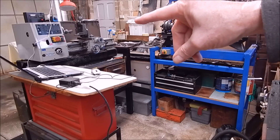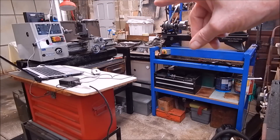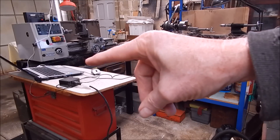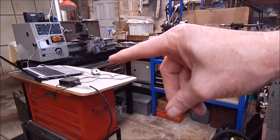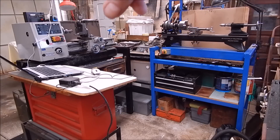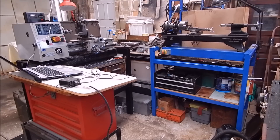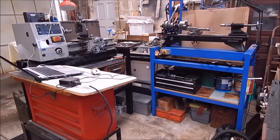You can see here the work area — the Chinese lathe over here has got the gear cutting setup on it. I've got my laptop computer here because this time around I used the USB microscope to do the indexing, and it worked absolutely fantastically. It was so much better than a pointer — the accuracy was fantastic. You pump up that one mil line to about ten mil and you've got no problem at all. I can't recommend it highly enough for indexing work.